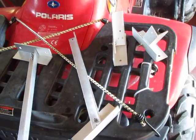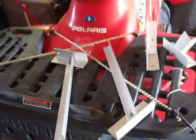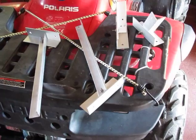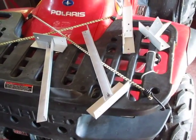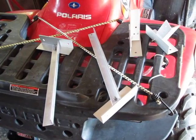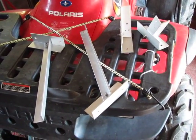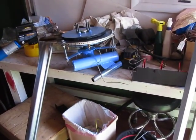This is going to be a 24-volt system with 200-watt panels. They're Grade C, which means they're electrically deficient. Panels come in different grades — A has no imperfections, B has physical or visual blemishes, and Grade C has some electrical issues where they're not putting out exactly what they should, maybe a bad cell here or there. But the cells are doing pretty good — I started charting them and was actually getting over 200 watts at their prime.